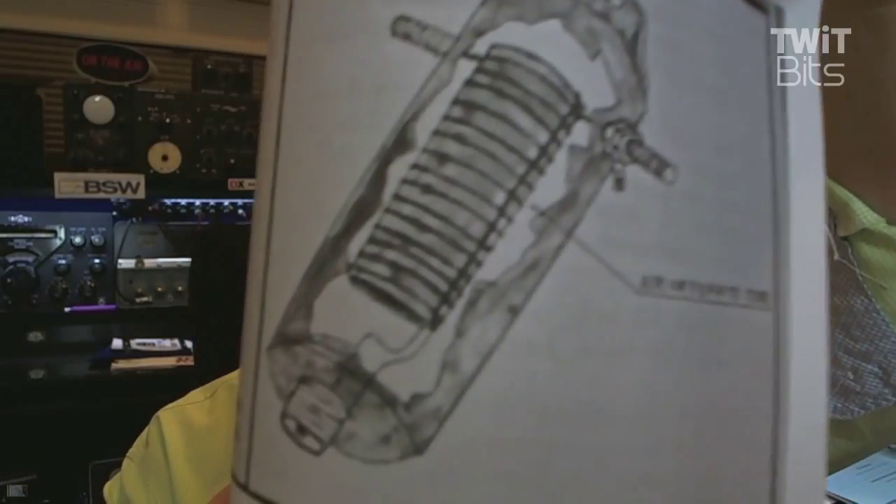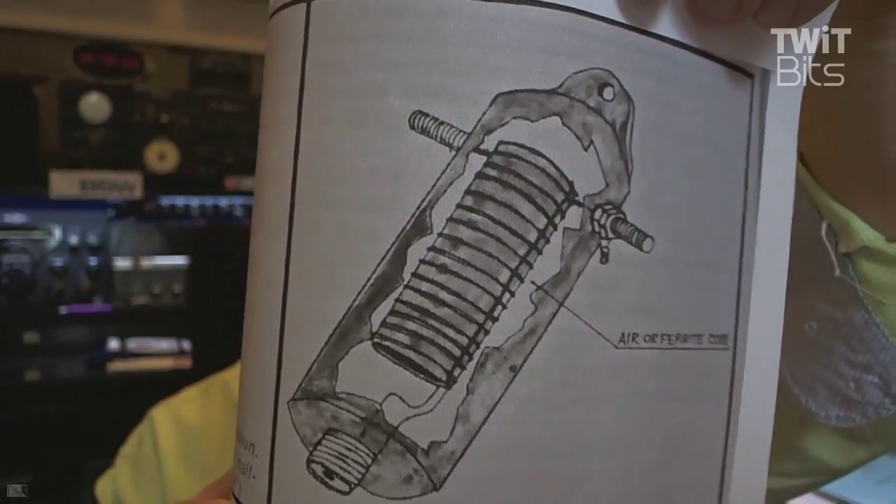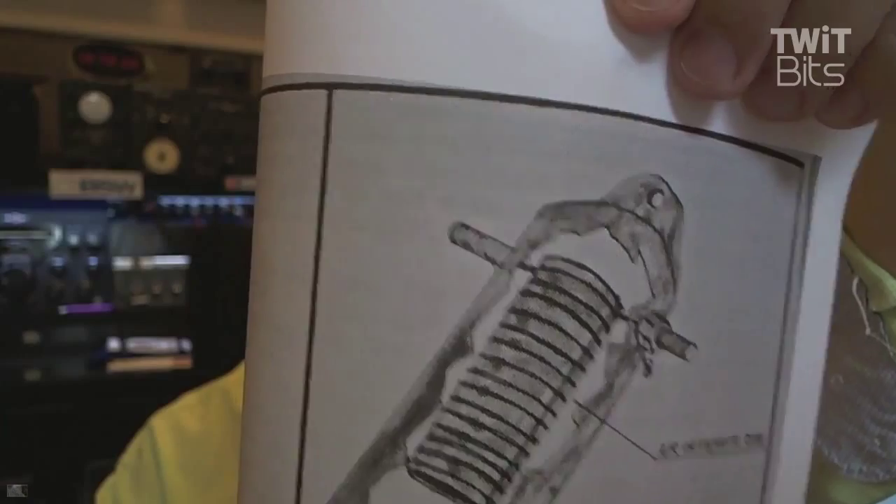And what happens inside this magic little box is a transformer, and this is what it looks like. This way, the outside shield of that coax does not touch the antenna — it's conducted through a transformer. We have a balanced antenna and an unbalanced line, and that's a one-to-one balun. And you really want to pay attention to that. I've helped a lot of guys solve their RFI problems by putting a balun up at their dipole and getting rid of that RF on the shield of the feed line. It's just a real simple little thing.